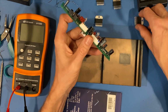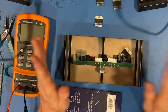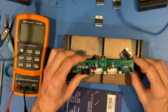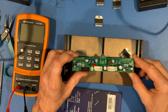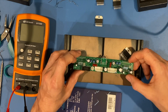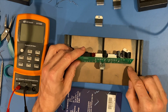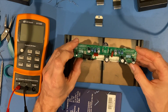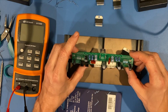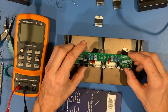We're going to mount these ICs and the circuit board all together without soldering anything first, because we're going to have cleaned up these pads so well that the ICs will just sink right in. When we solder them, if we have to get to the back side, we can at least do the bottom 100% and then pull the board as needed, and then do any finishing touches on the top if we need. We shouldn't need to if we're using flux the appropriate way.